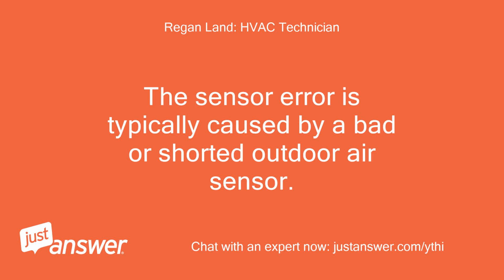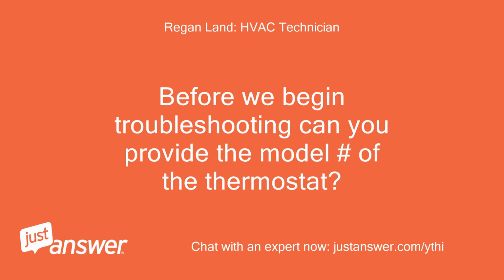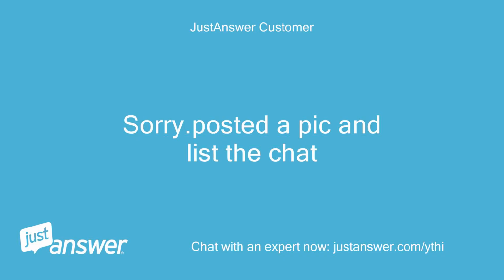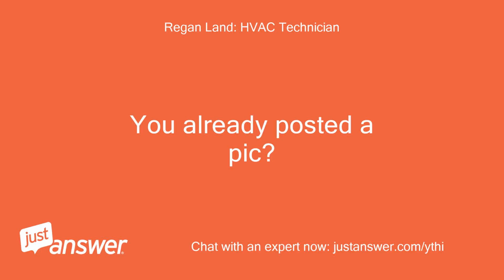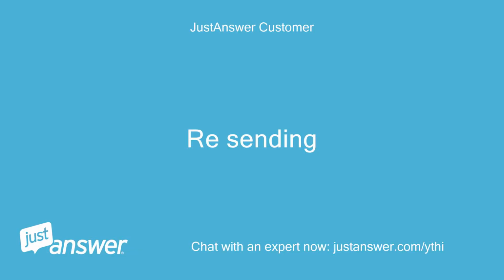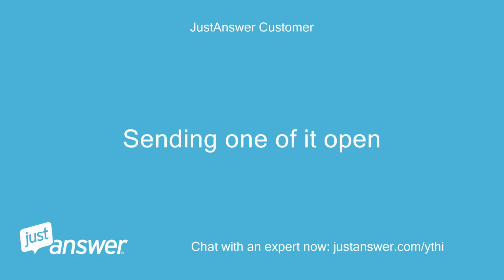The sensor error is typically caused by a bad or shorted outdoor air sensor. Before we begin troubleshooting, can you provide the model number of the thermostat? If you're unsure, can you take a photo of the stat and post it to this chat? Sorry, I posted a pic in the chat. You already posted a pic? I'm not seeing it just yet. Resending. Sending one of it open.